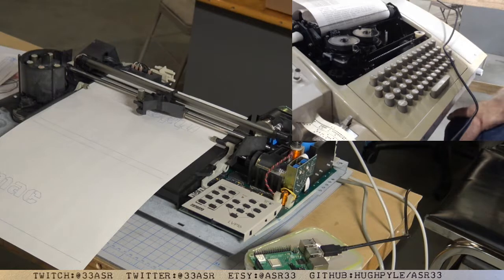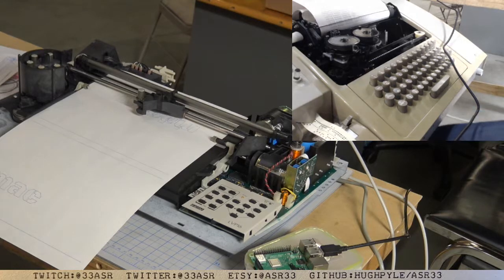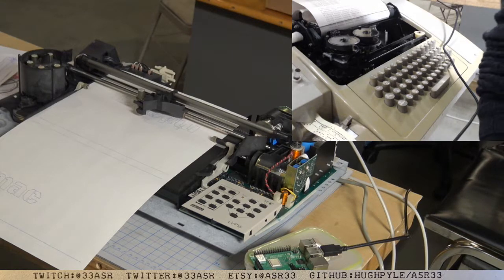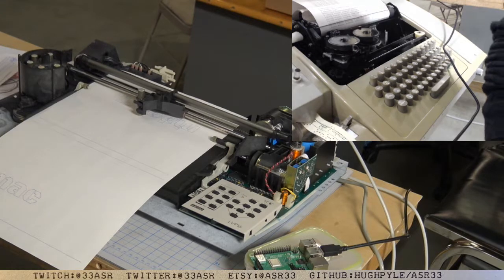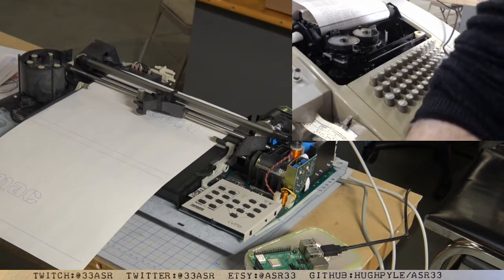That's really interesting. It broke in the same place. So maybe it is flow control. So I need to do some tests that force it to be PDF and not PostScript, and test something that sends it very slowly to the port instead of sending it all at once, so that I don't get flow control issues. And those are my next steps for a different day.